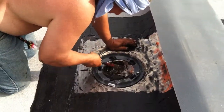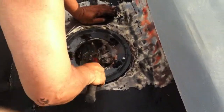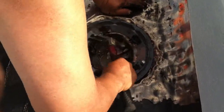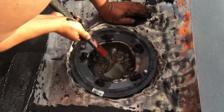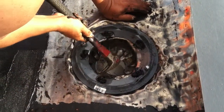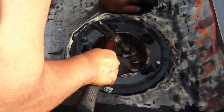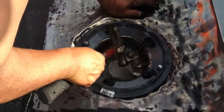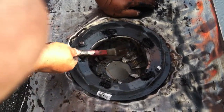Now we're going to pound this lead in here. It's very important that we get it down into the bowl. We already squeezed the screws down. You want to leave that lead in there, and you'll see roof cement coming out from underneath it — that's what you want. If you want a good, tight seal, you see all that roof cement, it's very important.